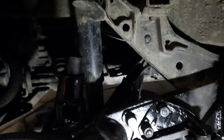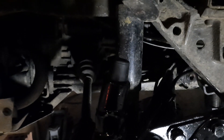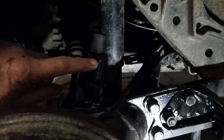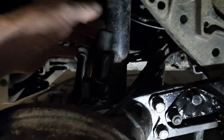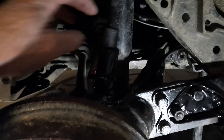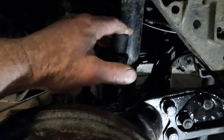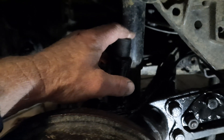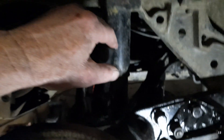I made up a new bump stop. Before I put the shock back on, I pushed it right up as far as it'd go, then made up a bump stop from just a couple bits of pipe and a plate with a nut welded in the back. I used a hardware doorstop for the rubber. It might be a bit harder than the original if it ever comes up that high — like if I load it up with passengers — but it'll do. You've got to protect your shocks; they don't like bottoming out.